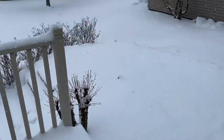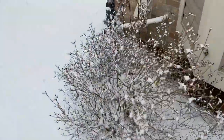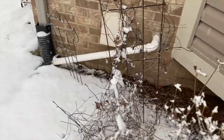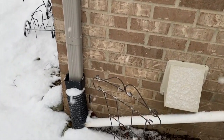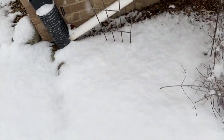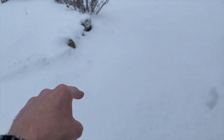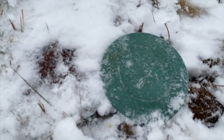Alright DIYers, we are outside and it is snowing — no denying that. Coming down here, this is the exact point where the sump pump pushes water up and out of the house, making a downward angle, joining all the water coming out of our gutter system, feeding it off the roof and underground all the way out to our yard. The discharge point is right in this area. I'm going to grab a shovel because you do not want that covered or blocked — and there it is, there is the discharge point.